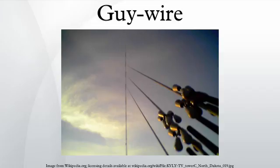Thus the bottom part of the guy is vertical and does not obstruct headroom, so a sidewalk can pass between the pole and the guy. An alternative to guy wires sometimes used on dead end poles is a push brace pole, a second pole set at an angle in the ground which puts diagonally against the side of the vertical pole.